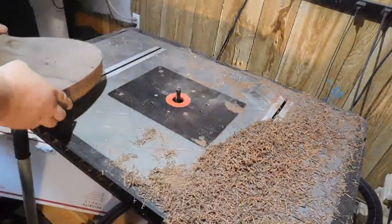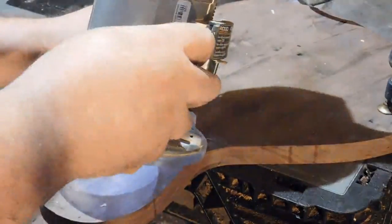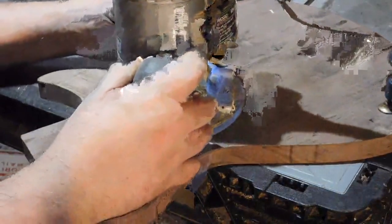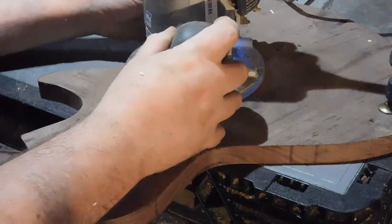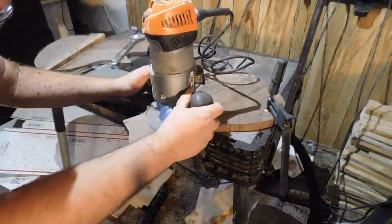Here I just had to do an internally chambered guitar for the wire routings. I marked it out and then routed it freehand. The lines weren't real straight and they actually wound up being a little wider than they had to be. I used a regular fixed-base router and it took several passes — I was trying to be as precise as I could, but it's still kind of wavy. I don't really recommend doing it this way; it's always better to set up a template or an edge guide for much cleaner results. If the routing is too rough, wires can get hung up on the edges, but on this guitar they were wide enough that I had no problems running the wires through.